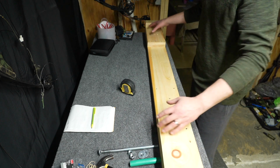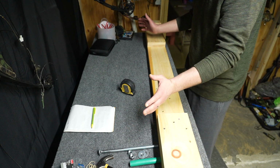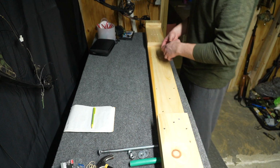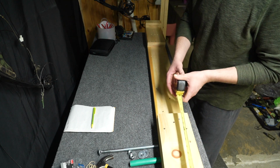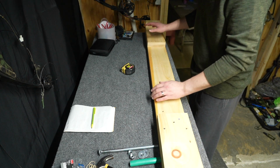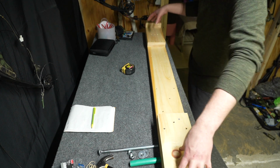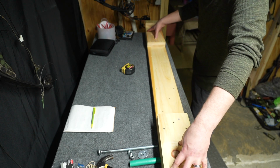Of that 3 feet, you could cut this to 2 1/2, and if you wanted to wall mount this or mount it to your bench, if you're not going to build it as an integral part of the bench that I have, which I'll show you later, you would not have to add these extra support plates. These extra support plates on both ends are roughly about 14 inches long. This one here is 16 inches long, but that really doesn't matter. Like I said, you have about 3 feet of cutoff length, and all these are doing is beefing up the ends where you're going to bolt in, using either lag bolts or nuts and washers, your winch down here on this end, and your post down here on this end.